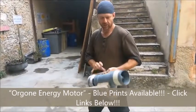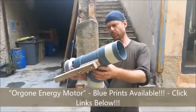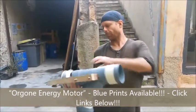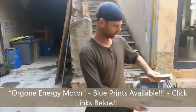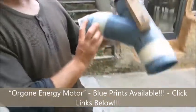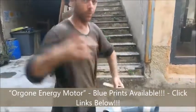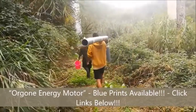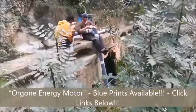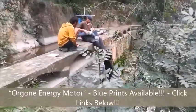This is the phase 3 turbine. It's similar to the previous ones that we tested. I am going to flip it around direction-wise though, so that the water is going to come in from here. We're going to move it further down the canal with about a 2.2 meter drop instead of the 0.9 meter drop, which should give about 3.5 times as much power overall.